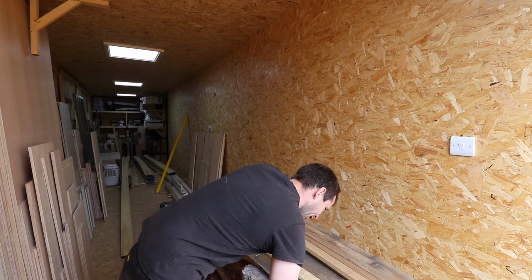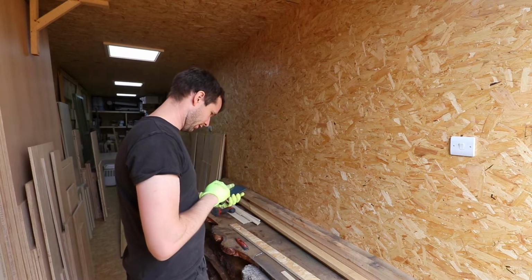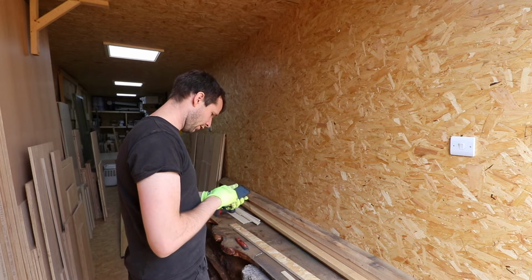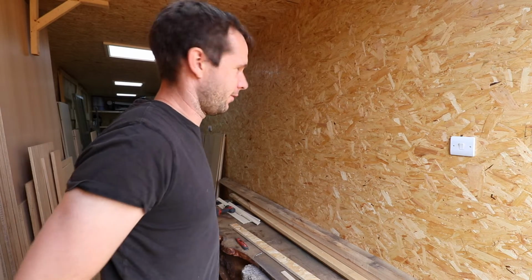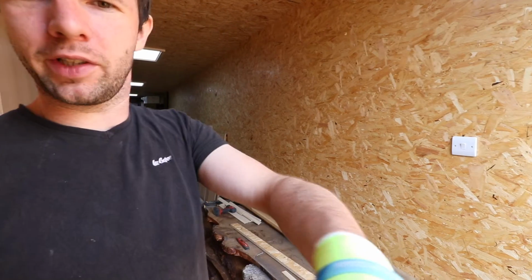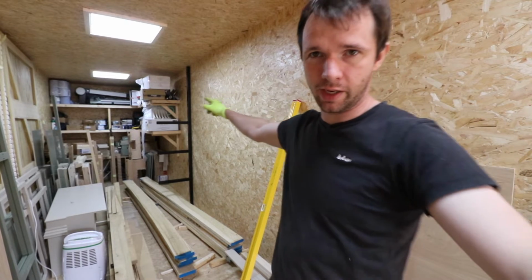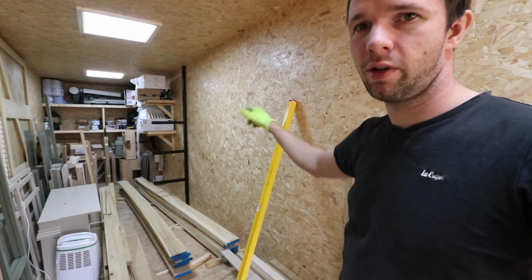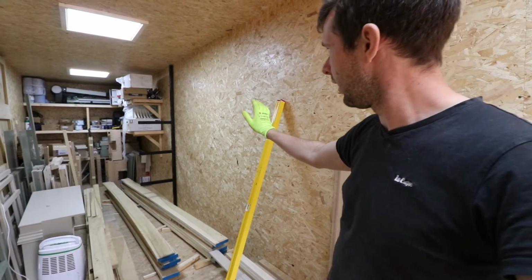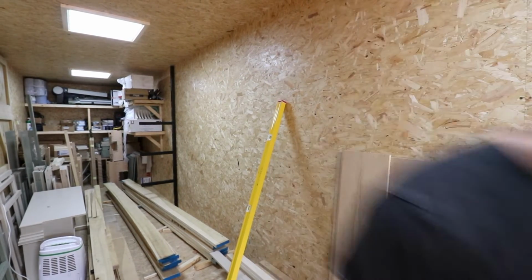6864. And that's divided by, with 6 frames there'll be 7 gaps. So 6864 divided by 7, it's 980. So just under a metre per frame. So I can work from that other end. If I just add 980 on and then mark a frame, we should be good. Notice these end frames are missing the top rung across here. So the end 4 of this end of the racking is going to have that bigger gap at the top, so I can store some cabinets on that top layer.